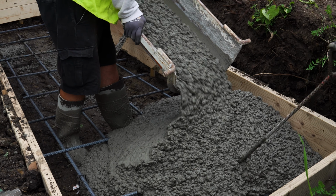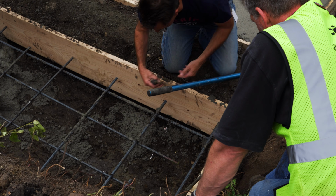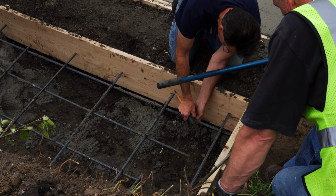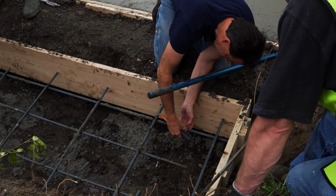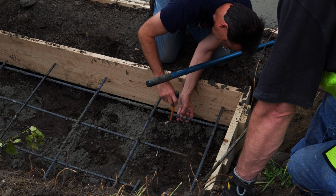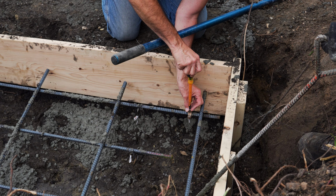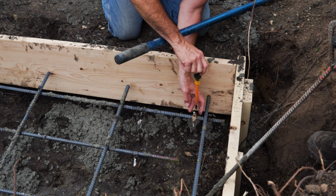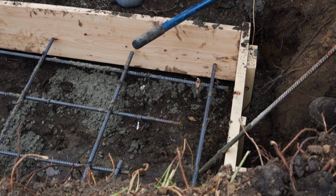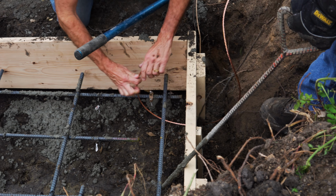We had to break this one into 2 slabs because we did have a drainage culvert that ran between the two where we needed to put the sign. So that's why you're seeing 2 separate slabs broken apart. We were a little bit worried about that heaving, so we set the footings on both sides of it, bridged them together, and left a couple of feet between the top of that culvert and the footing just in case it were to heave or move from the moisture at any point in time.